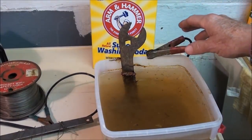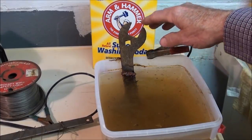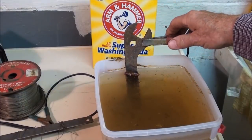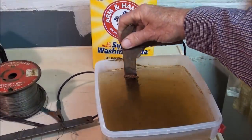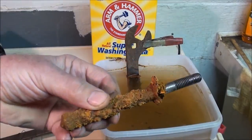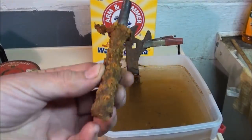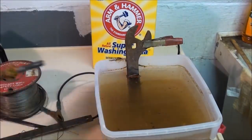This is a 12-volt battery charger, so the positive will go to what we call an anode, which is any piece of scrap steel, and I'll clip it right on there. That is sacrificial — look at how that's already been encrusted. I did one other part, encrusted with what I call niter. I don't really know what niter is, but Vincent Price used that word in Fall of the House of Usher and I've been using it ever since. There's a piece — this was a rather brand new steel bolt — and that's what it looked like after doing one batch.